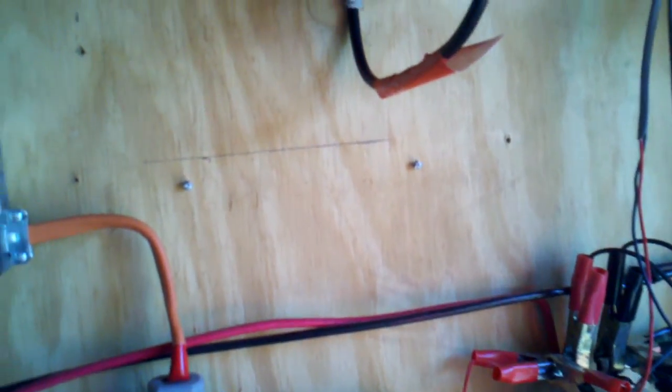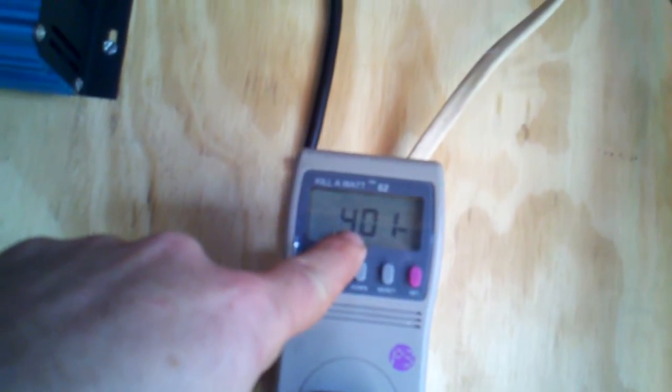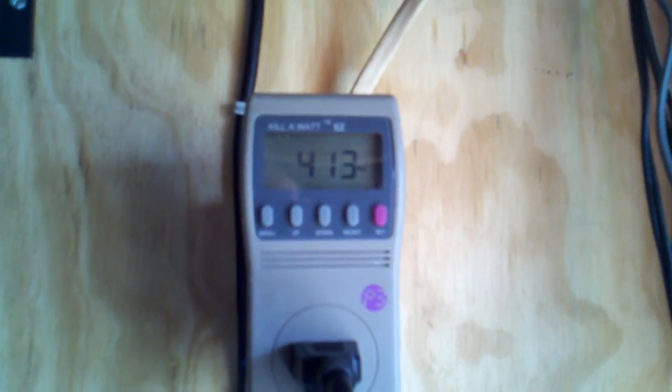That's as far as I got so far — the little panels are pumping some juice into the battery bank. I'm going to do a test on the digital meter. I'm pretty sure by looking at it that I don't have a smart meter — it just looks like a digital one. I'm going to assume that if I'm using more electricity than I'm producing, it'll all go to the house, but if I'm producing more on this particular leg than I'm using, it's not going to feed back into the grid — it'll just kind of deadhead, or it'll get fed back into the grid but nothing will register.